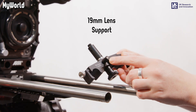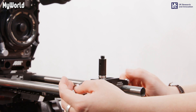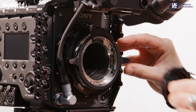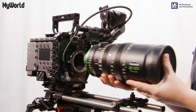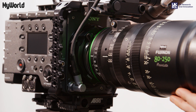Make sure the lens support lever is unlocked, place onto the rods and screw into position. Turn the lens mount retaining ring to the left and remove the cap. Make sure the screws and pins are aligned, insert the lens, then rotate the lens mount retaining ring to the right to secure the lens.